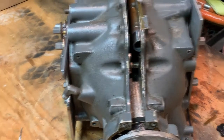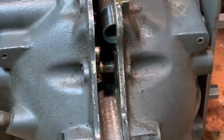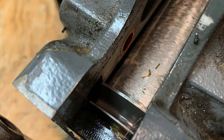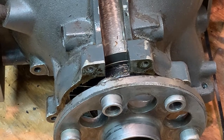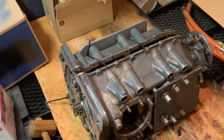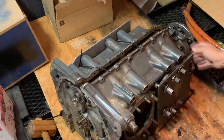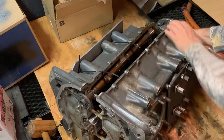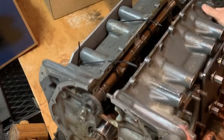Both plates are completely screwed down now all the way — they've done their job. The case is separated pretty nicely. You can see the camshaft in there sitting there, and if you look down you can see some faint amounts of scrapings off a copper bushing that's in the left-hand side of the case up front. I think we're about ready to just pull the cases apart by hand. At this point the case should actually just separate without very much effort at all, so have plastic bags ready for the tappets. Here we go — easy.